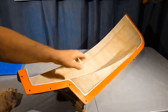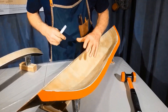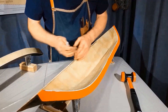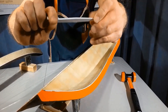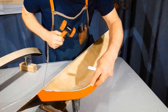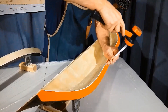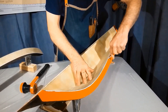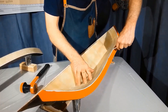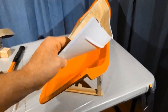I'll bring all four molds up to the same stage. Now a two-part mold doesn't have nearly the pressure holding the part in as a single-part mold. I'll be using a little plastic sculpting tool that's quite soft and flexible. To start the release is along the shear line where I can go straight down with my wedge and give it a tap. So now this wedge can be worked along gently, and there's the part.